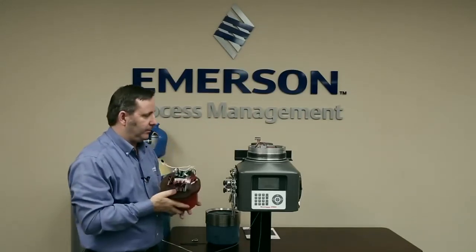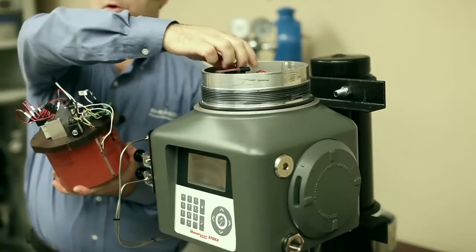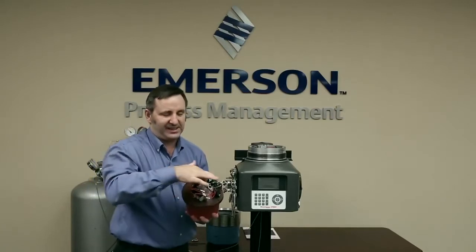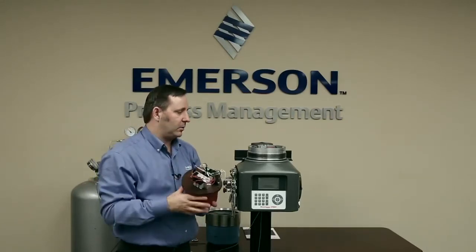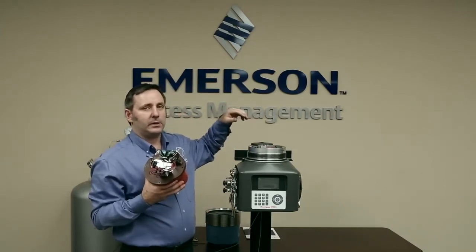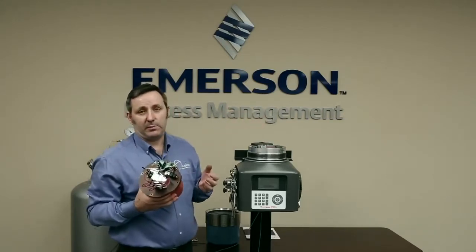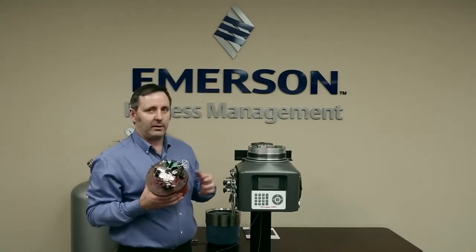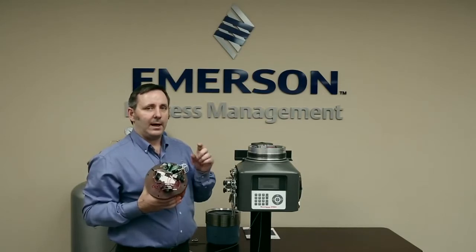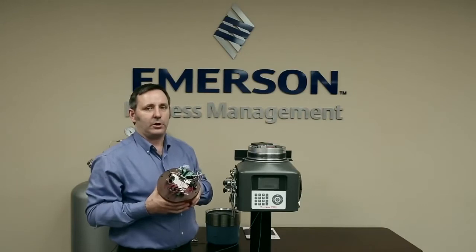It's really important when you take the oven off — there's a set of O-rings on here on what we call the feed-through. Sometimes when you take the module off, these O-rings actually stick to the bottom of the module. You want to make sure you take them all off. Also, you want to replace the O-rings when you put on a new module, because you don't know how long these O-rings have been there. When you get a new module, inside the kit will be a bag of about 10 of these O-rings.